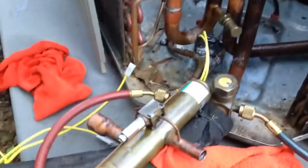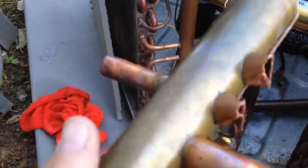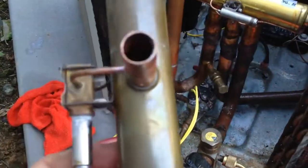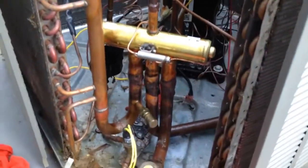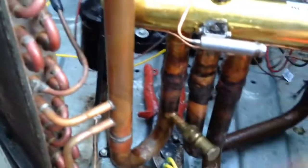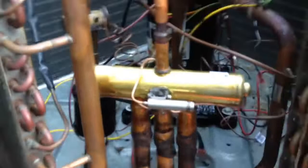There's the bad valve — the leaker. It's bypassing real bad, but that should fix them up. I'll get this thing vacuum pulled and get everything put back together. You pretty much have to disassemble it to get to the reversing valve — there's just no other way to solder it because the thing is so close. There's a little access panel at the bottom but you can't get your torches in there to really get to it, so it's just easier to unwire everything and get it out of your way so you can do a good job on it.